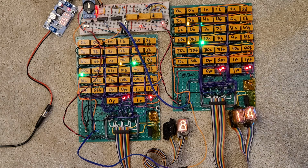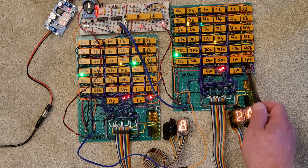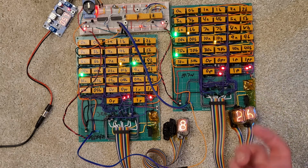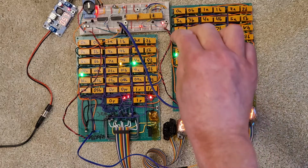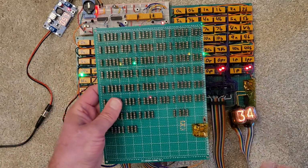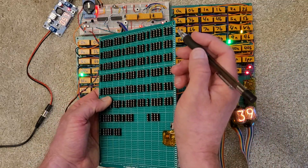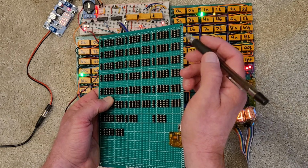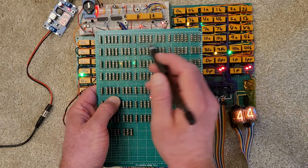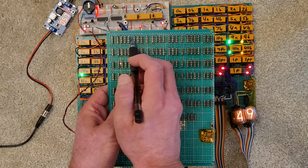I laid them out, like I said, pretty much the same. The one big change I made was before the relays were sitting on pins from those terminal strips, and it wound up really hard to put the relays back. And so I did this method. This is the hours counter. I just left that terminal strip intact, and I just broke it off. And it stabilizes it, and there's still room for all the components to go in between.